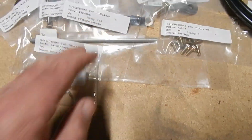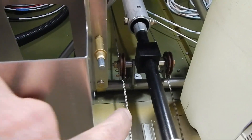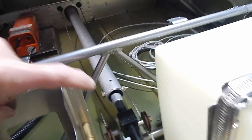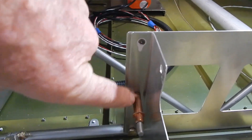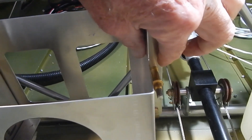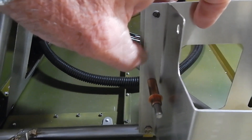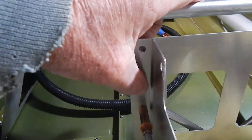To figure out the placement of the box, I put the bottom bolts in through the clamps on that bottom cage and tightened them loosely so I can move the box right or left. We know there's a bolt here, and on this side you have one rivet and one bolt, and you've got to determine where that other bolt is going to go. Since this side is definitely a bolt, I'll move the box right and left until I had it lined up with a clamp on this bar, secure it, and then that'll tell me exactly where I need to drill. Once you get the right side set, that'll let you figure out where you have to drill the left side for the bolt and the rivet.